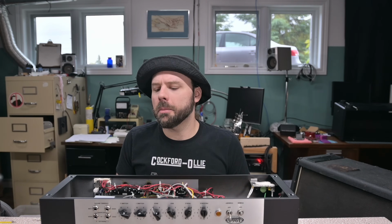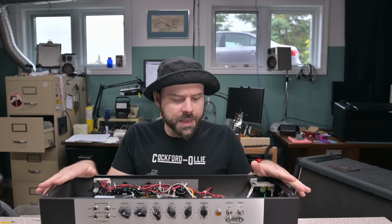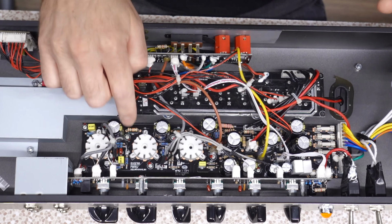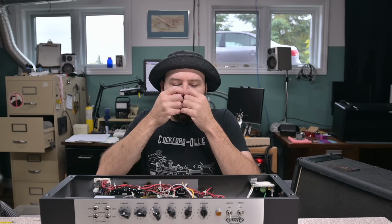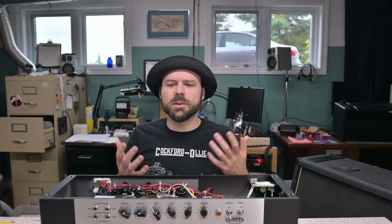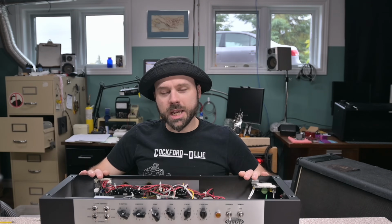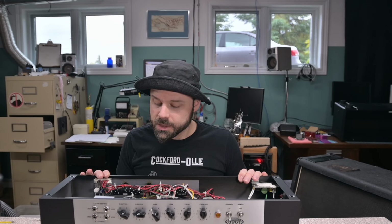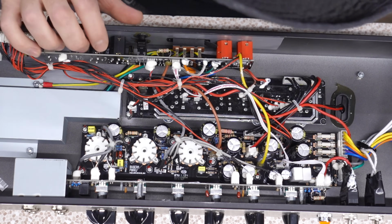As I recall, when these amps came out, part of the marketing talked about how they re-engineered these things. They didn't just straight up copy the 1960, the Super Lead. They took the Super Lead schematic and they re-engineered it to modern spec. That means the layout and the PCB design is going to be optimized. You know, back in the days of Marshall and Fender, it's just kind of like, okay, we got to build an amp. Okay, there's all the components laid out. And debatably, some of what they did was wrong. I've worked on some older amps, studied this older design, some of the way they do grounding schemes, and it's not technically correct based on what we know of electrical engineering now. Bugera's taken those concepts and engineered them into this amp, and the result is you're gonna hear, when I do the listening tests, it's really friggin' quiet. Here is the effects loop section.